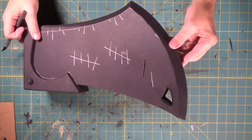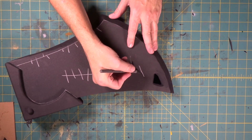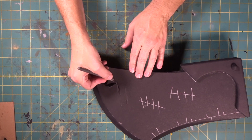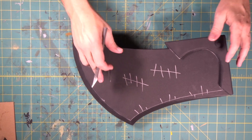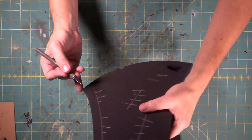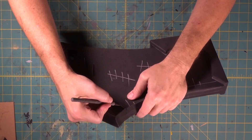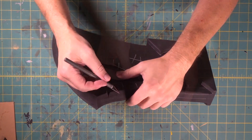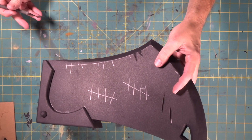What comes out is a little V cut — and look at that, that's a really nice natural looking gouge. Let's do that on this side too. Coming from the other side on an angle, just like that, and there you go — beautiful gouges. Now just take your time and go through all these on this side too. Look at that, going around the edge — that's legit. Perfect.